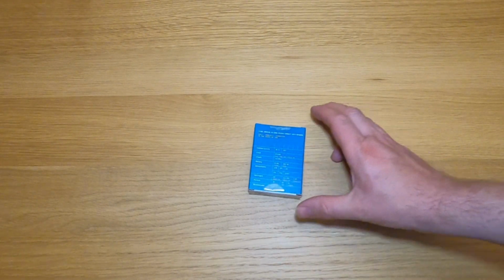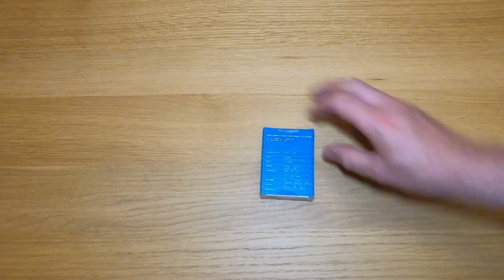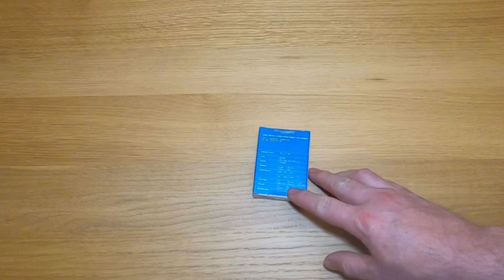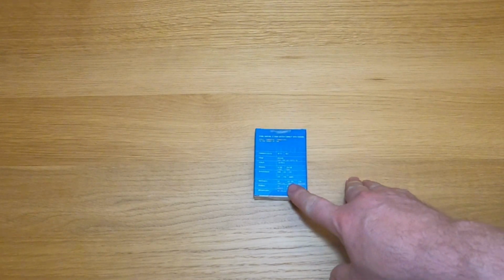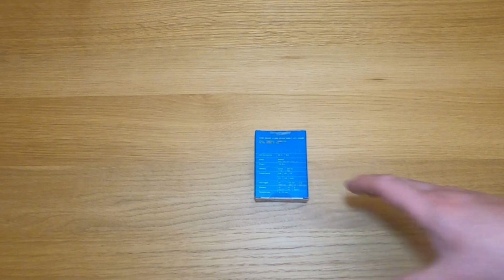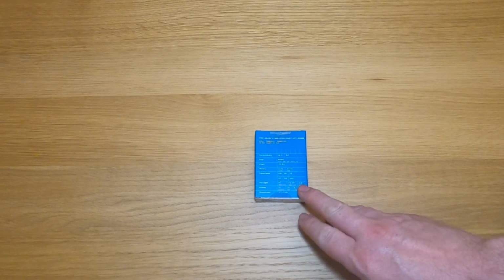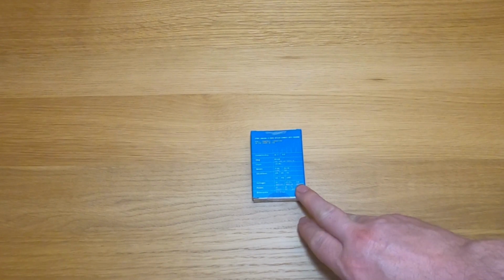Voltages: it's 5 volts through the USB input. It's 4.5 to 21 volts through input VIN. That range actually sounds really useful because the upper end, 21 volts, is probably going to be quite useful for those looking to integrate these or use these on model railways, which typically work around 19-20 volts. But the chip itself runs at 3.3 volts, and that's very important.